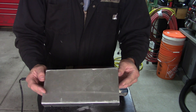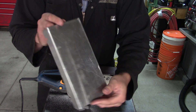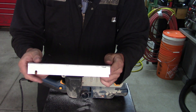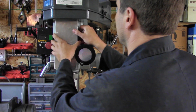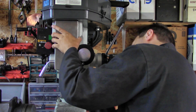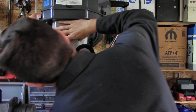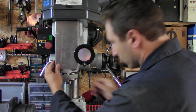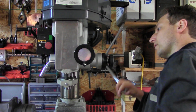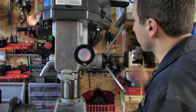Considering the fact I don't have a metal brake, this is about as good as I'm going to get. The welds were kind of ugly before, but taken down a little bit with a sander, smoothed off and blended in — that's about as good as I'm going to get. Now let's see how this thing fits. Nice — yeah, that'll work just fine. Get it up above that little ledge. That nut inside isn't interfering with the cover at all. Pretty flat on the front; I think that's a success so far.